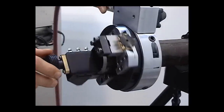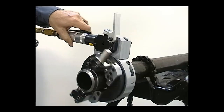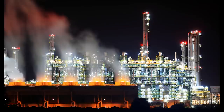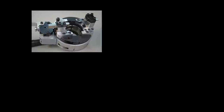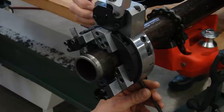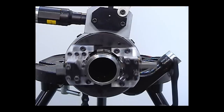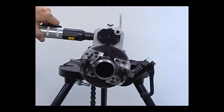This machine is capable of simultaneously cutting and beveling carbon steel and its alloys up to seven sixteenths of an inch wall thickness. Able to counter bore, perform socket weld removal, and chipless cutting, you will find this compact yet powerful machine in industries such as oil and gas, petrochemical, power generation, and shipbuilding applications. The SDSF is made of alloy steel with hard chrome coating and low friction adjustable bearings that provide maximum stability and extended machine life, available in pneumatic or electric.